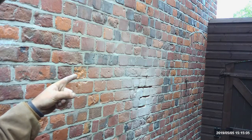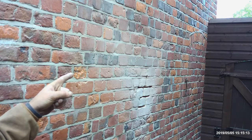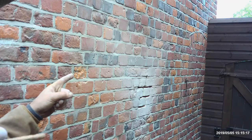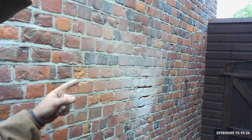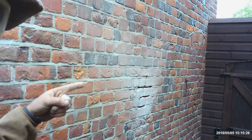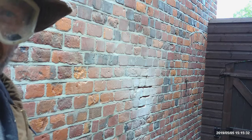Bricks like that, where they're end on, and unfortunately, if this is some sort of weird hybrid Flemish bond idea that someone's come up with, they bridge between two lots of bricks, you're going to find that very difficult to get out. But you can grind around it, so go around the end of the brick and snap the brick with a bit of leverage, but don't grind anywhere around this brick, or these bricks, because you'll break them too. You need them to be up against something.